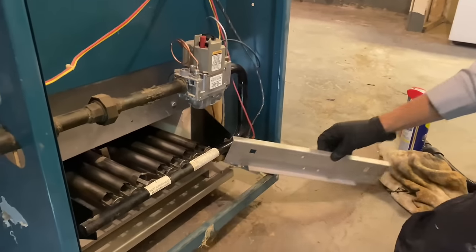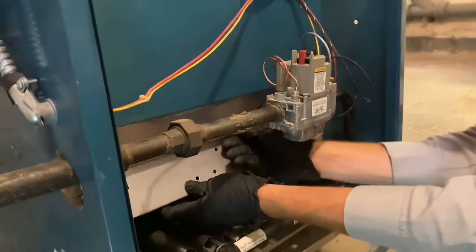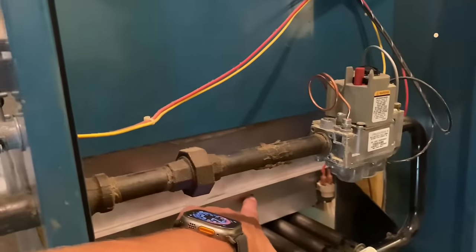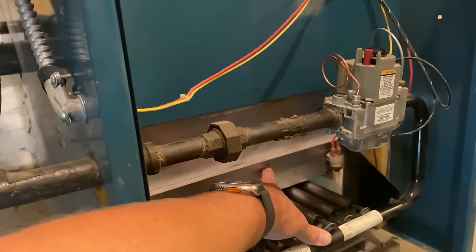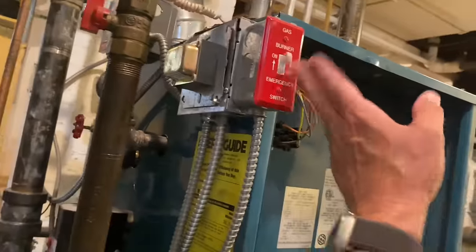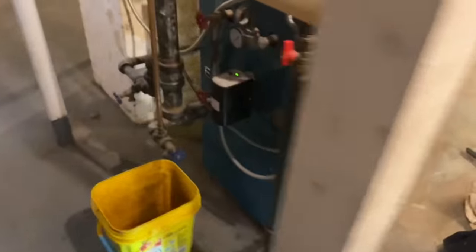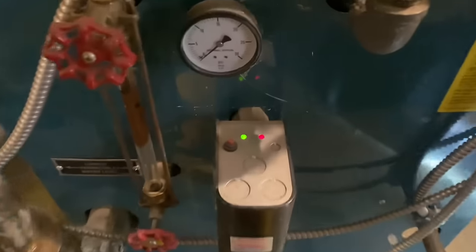Our pilot is relit. Let's put the combustion chamber plate back on, making note that the rollout switch is in the proper orientation — which it is. On some systems you'll have a shipping screw there — it's always best to take that out right away because in 20 years you're not getting that screw out without a grinder or drill. Now let's turn power back on, put it back to the on position, and focus on the draining. I already took the liberty of draining one bucket; our low water cutoff is flashing a red light.